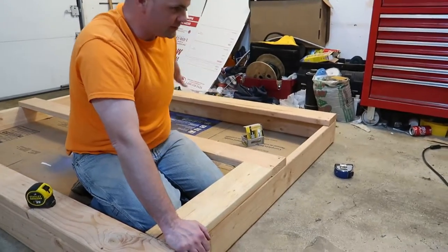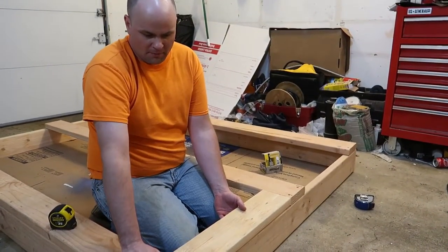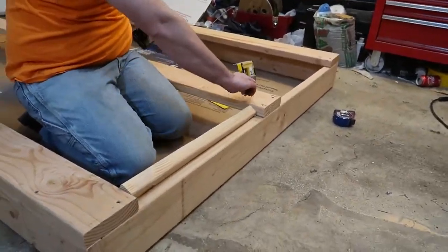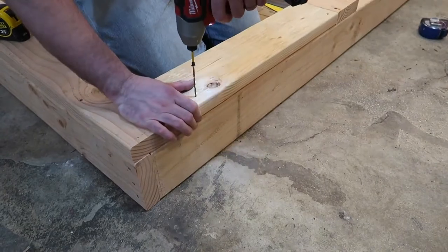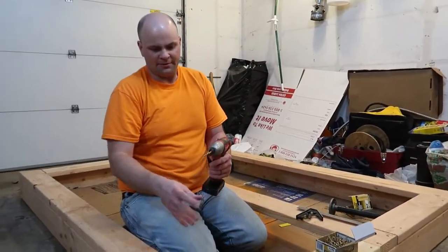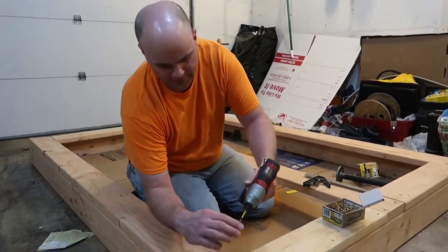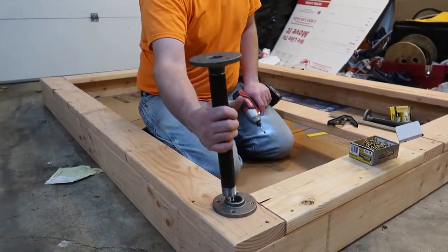Now I'm at the point where I'm measuring out these boards, and I got another piece of scrap there. I want to cut up another board and then have this lip here, and then attach my pipe nipples and the floor flanges. I want one on each corner and one in the middle, although I don't think that would be necessary. I found a space I want. I'm switching to an interior wood screw — I think they call it a yellow zinc screw. I'm attaching the floor flange with a one-inch pipe nipple — that's just going to stand for the bed leg. It ain't going anywhere.